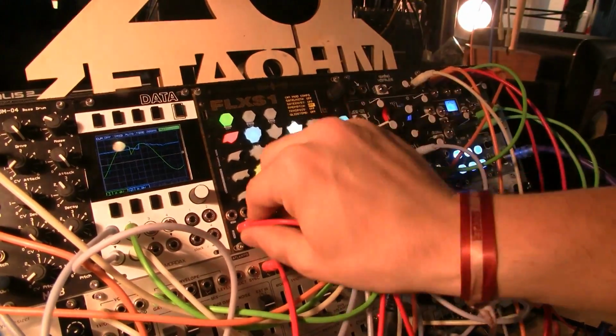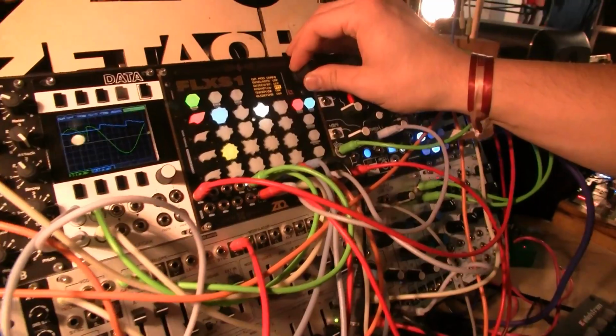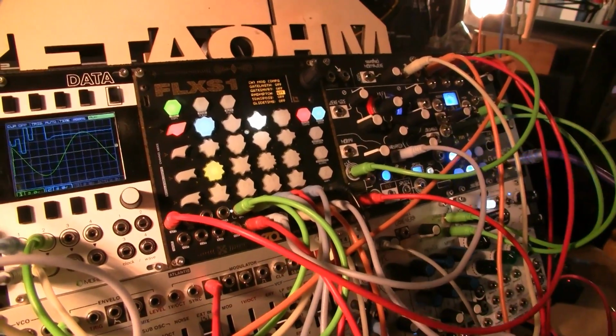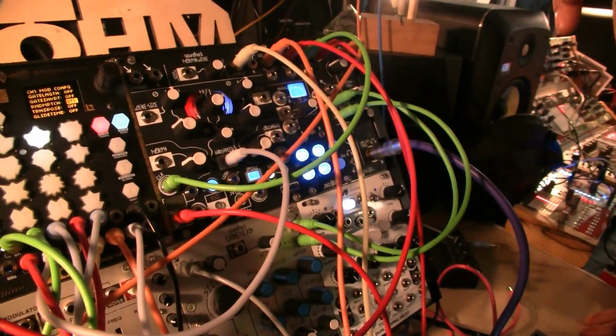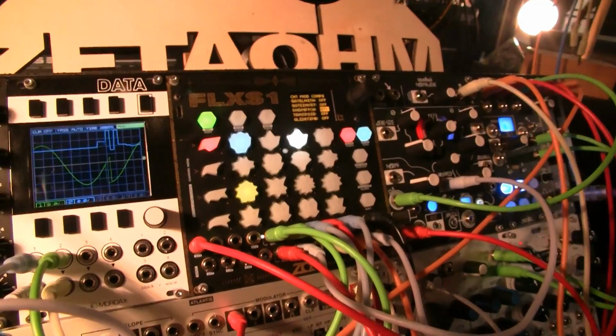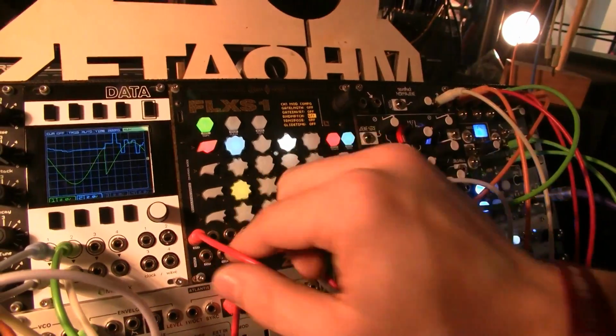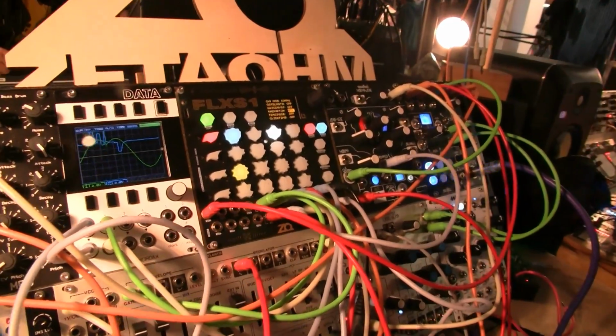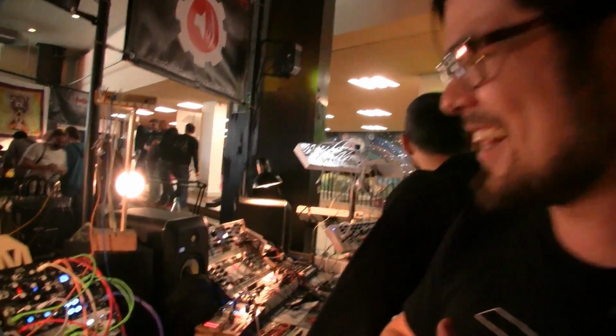You can randomize the pitch on gate input. So every time that gate is high, it'll randomize the pitch. You can modulate glide time as well. Could you make that random pitch stay within the key that you're working in? You will be able to. I actually put the randomization after the quantization accidentally in software, so that's a fix I'm going to be putting in very soon. No problem.